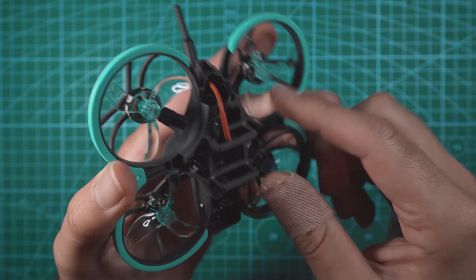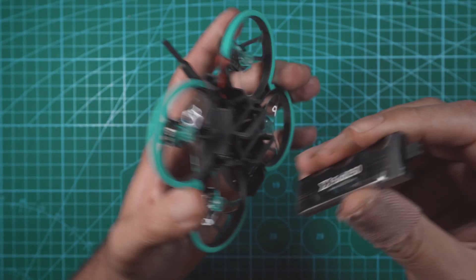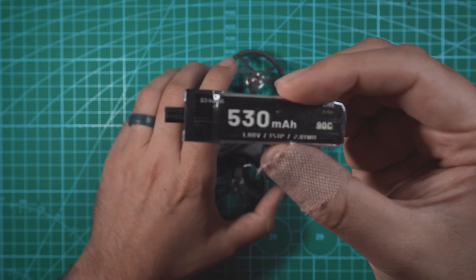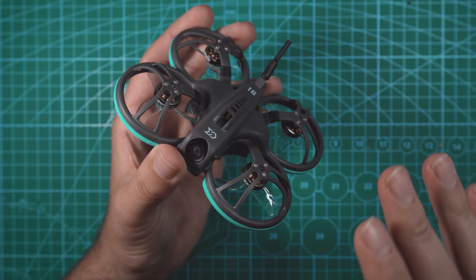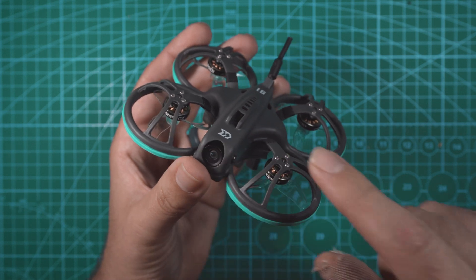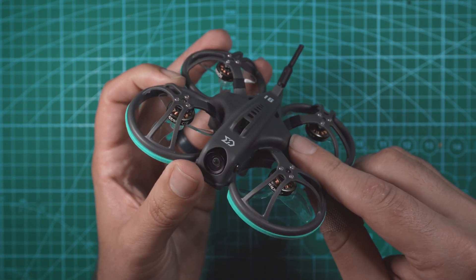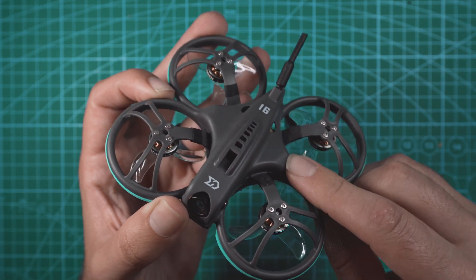Looking at the bottom of the drone, we have a little tiny cage for the battery. We have the battery connector coming out the back — the GNB27 connector. They include two 530 milliamp 1S LiPos. You could probably fit a slightly bigger 1S LiPo in here — just make sure it has the GNB27 connector. Since this kit comes with analog goggles, we've got an analog VTX and camera on board. The camera is the Caddx Ant, and the VTX is a built-in 200 milliwatt VTX that's actually part of the flight controller, which is Sub 250's Red Fox A1 F4 5-amp 4-in-1 1S flight controller with a 2.4 GHz ELRS SPI receiver and video transmitter built in.